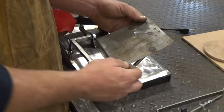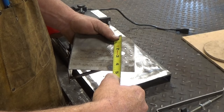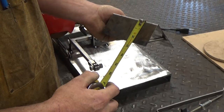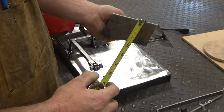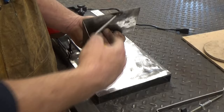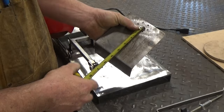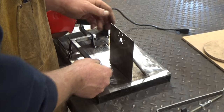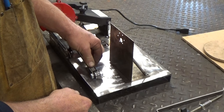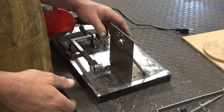Our little motor stand is just that same 16-gauge sheet. Dimensions on it are 4-5/8ths by 5½, that's 2-3/8ths. The dimensions in the back aren't too important — you just need something solid to hold the motor in place. I've taken some ¼-inch rod and stiffened it up. The important thing is your center line: from there to there is 4½ inches. That accommodates the height of the wheel to the height of this. You don't want the wheel way down with no room to travel, and you don't want it way too tall either — that's just a good midpoint.